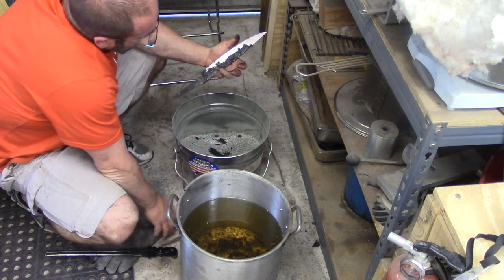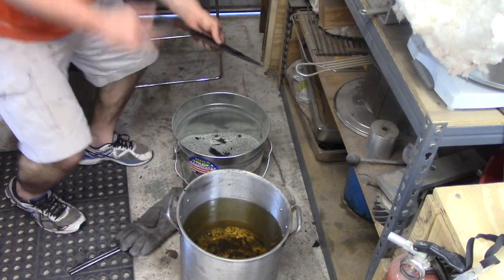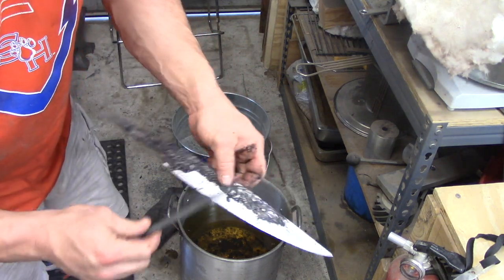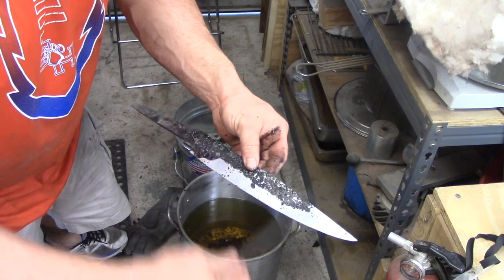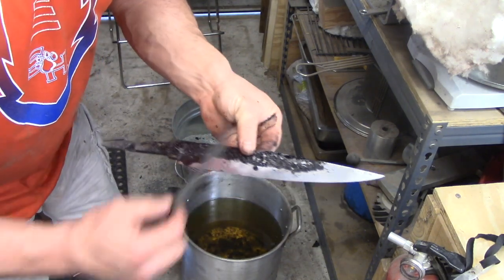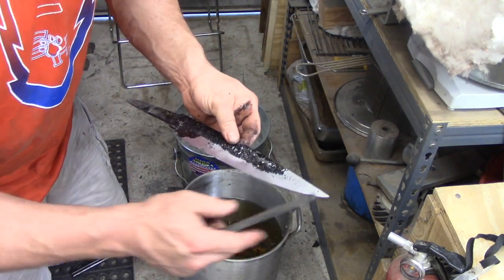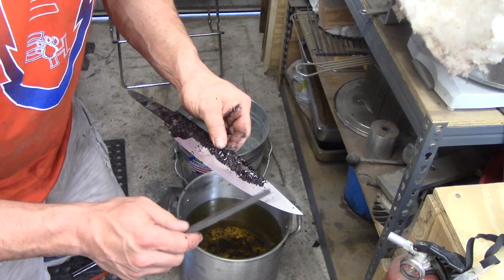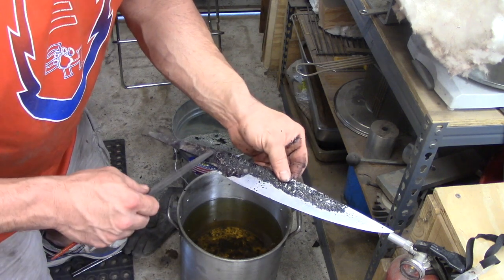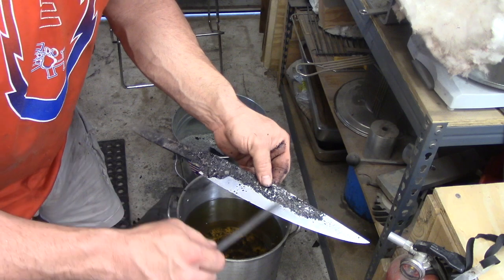Alright. So this blade, and just to check, if you're wondering, this is just a rudimentary test, but just to see if we've got hardened at the edge, I'll take this file. Hear that? You don't get much harder than that. Based on my testing that I've done with my Rockwell tester on the test pieces, we should be at about 64 to 65 on this hardened steel right here. Probably back up in the 50s and maybe the high 40s back here along the tang and spine,